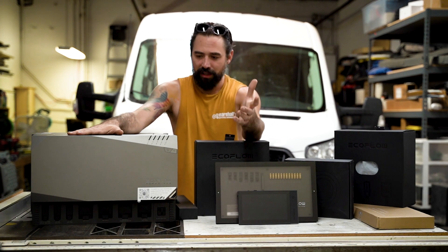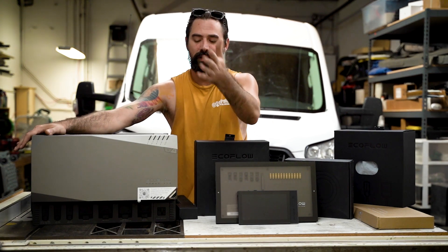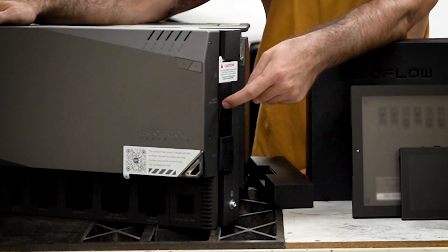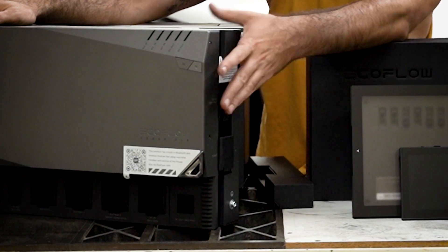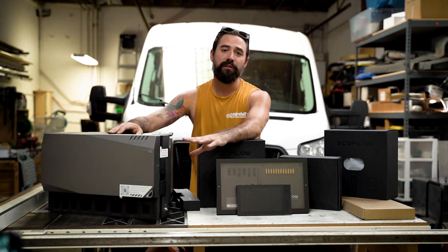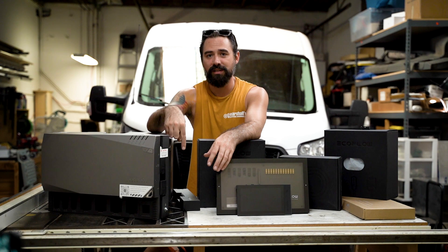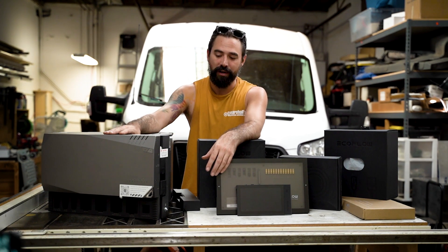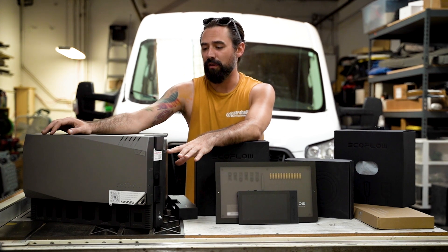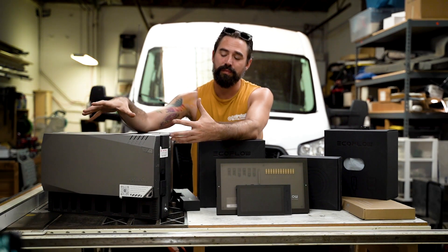Power outputs are on the side of the hub: an AC output and a DC output. One thing I really love about this system that I didn't know before getting it is that you actually get to choose whether you want to run 12 or 24 volts on the DC side. Just like the 48-volt battery, increased voltage means decreased amperage — more affordable and cooler wires. A lot of people use 12V because it's the most common, but having the option to flip to 24V just by a switch is pretty cool.